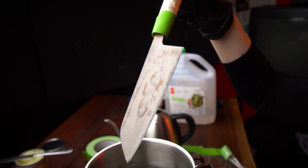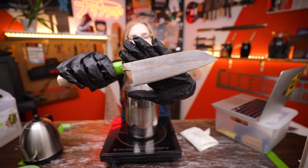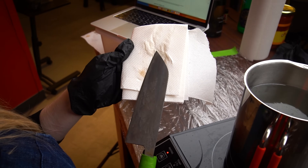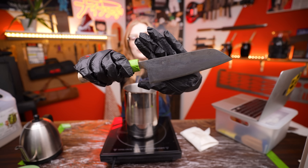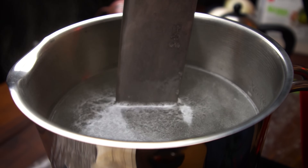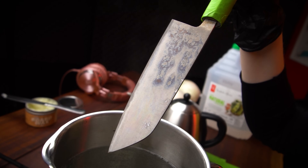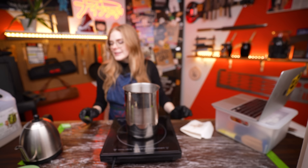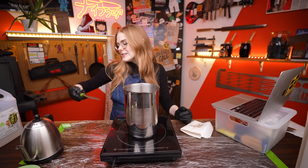Maybe the shaking is because the patina happens once the air hits it and not in an anaerobic environment. The magic with boiled vinegar really happens as a result of the heat and acid, because as the air hits it, that's when the patina forms. Pretty dramatic already. After three dips, we're getting a lot of interesting colors — blues and browns. There's a little bit of different result near the tang where the handle goes in, a little more on the brown side there, probably because it had more exposure to oxygen when being dipped.